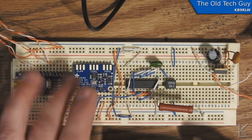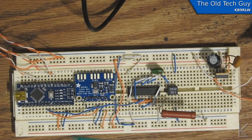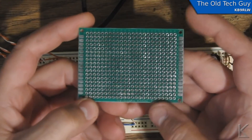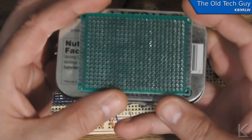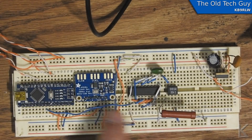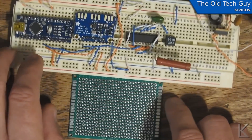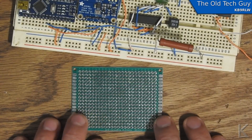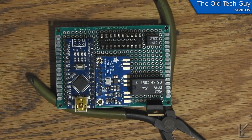That's pretty small to fit all of this on there, plus the low-pass filter and the relay — but I think I can do it. That will make the case just slightly larger than the PC board. I'm going to do a 3D printed case, and it might also fit in an Altoids tin, so this is a good size to go with. The trick is fitting these components plus the low-pass filter and a relay on there, so I first need to figure out the board layout.